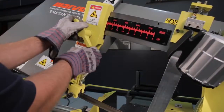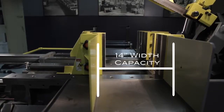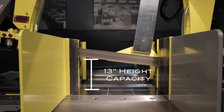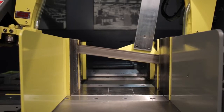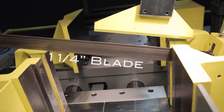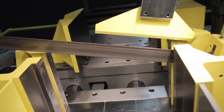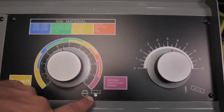The PA13-3EPC has a maximum cutting capacity of 13x14 rectangular stock or 13-inch round stock. It possesses a one and a quarter inch blade and has an infinitely variable speed range from 70 to 330 surface feet per minute. This broad range allows for optimum cutting of several different types of material.